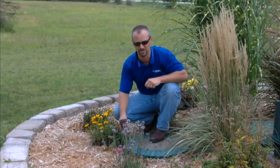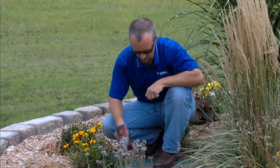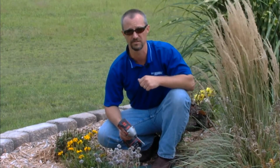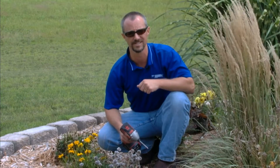The last thing you're going to want to do on the site is button up all your manholes and screw them down securely. Pick up your tools and whatever you've left on the site. Fill out your proper paperwork for reporting to the state or whoever is required. Then let your homeowner know what you've found and that you've done maintenance on the system.